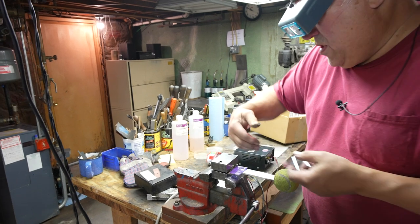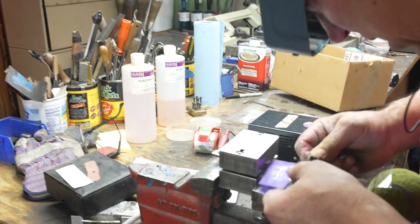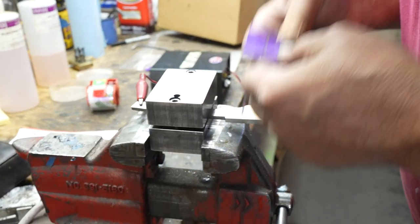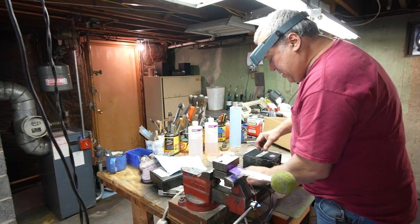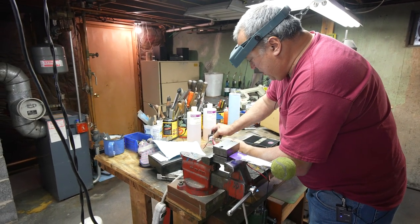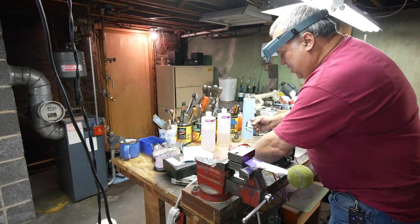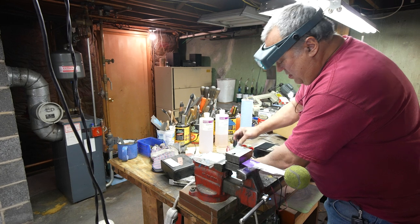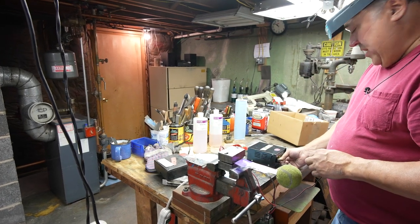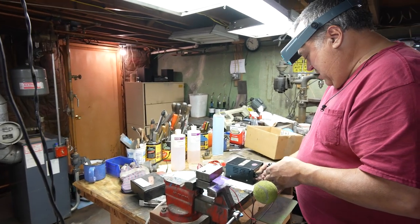Okay, presentation side of the blade. I like to make sure my Loukides is on the right side of the blade and not the wrong side. And I'm going to take this, dab it into the electrolyte, which takes the current coming through. And I splash off the extra. I always get too much on. It takes the current coming through and makes it transfer to the metal.